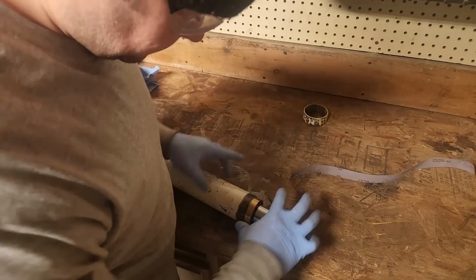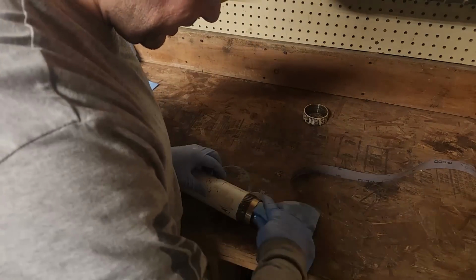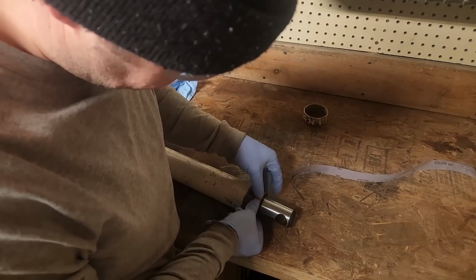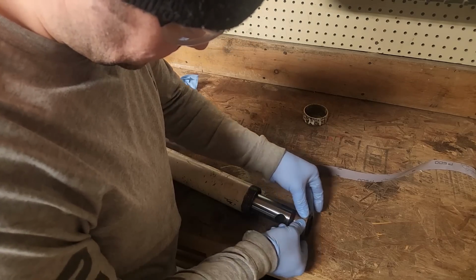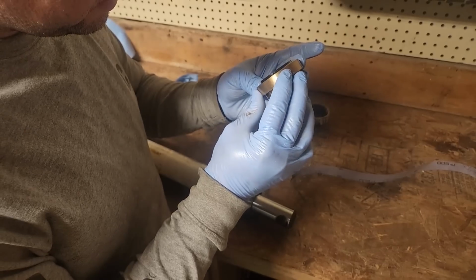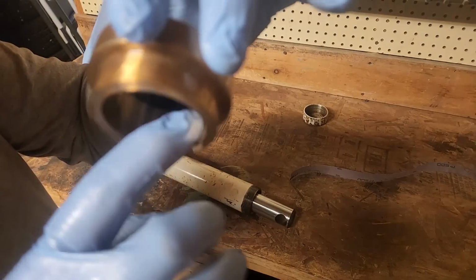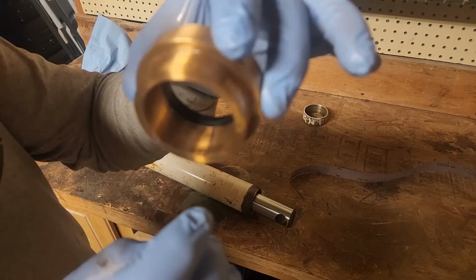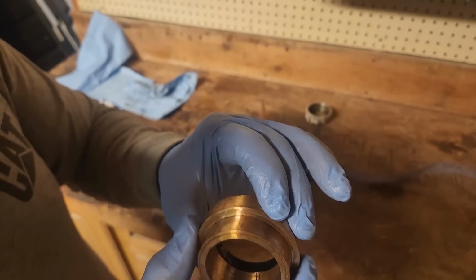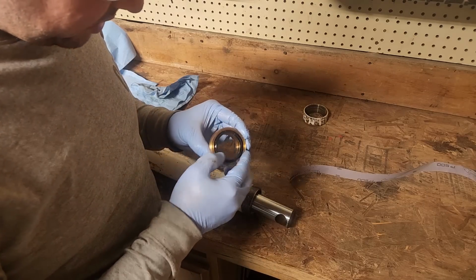Okay. Maybe it'll slide off now. Well, let me wipe it. Don't want sand getting into there, or abrasives. Maybe it'll slide off. Hey, there we go. So the lip seal seems intact. There's a huge gouge here. I don't know if you can see that, but big gouge there. Bunch of scratches. I wonder if that's from someone else resealing that and that getting stuck. I don't know.